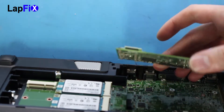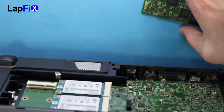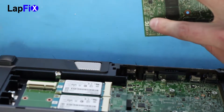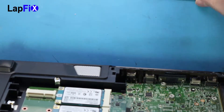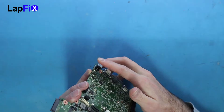What's right next to it? It's the graphics card. So with the graphics card — if you ever have a jack issue, you can check this side. Sometimes over here in this corner it can get melted or even burned. So if you have a DC jack problem, there is a pretty good chance in this model that you can also have a board issue and you can have a graphics card issue. We did take this apart.